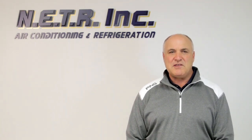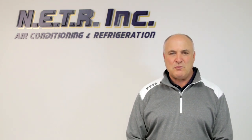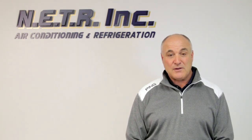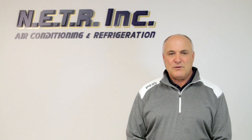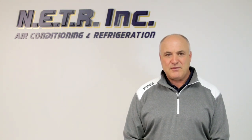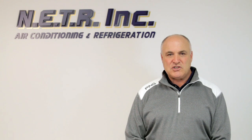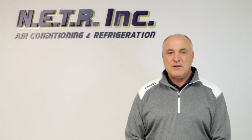I want to let you know some of the dangers of do-it-yourselfers trying to install this system in your home, because there's a lot of danger involved if you don't know what you're doing. People go buy a unit online and they think bigger is better. They buy a bigger air conditioning system than they even need, and it ends up cooling the home so much that it just runs and shuts off, doesn't remove any moisture, and you end up with mold problems in your home.